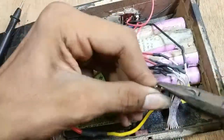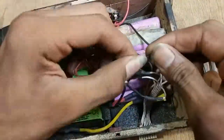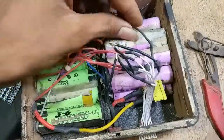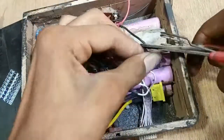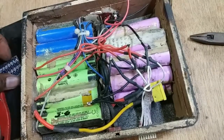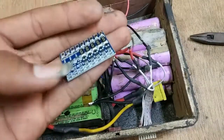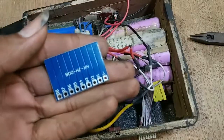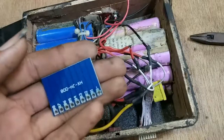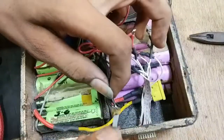Remove the insulation from the wires and be sure you don't short them when you do it. If you are a beginner in electronics or don't have a steady enough hand, then don't try to imitate it. Since my battery pack is 6 cells and this balance charge circuit only features up to 5 cells, I have to take risks and balance charge the last cell manually. If you prepare a battery pack of 2 to 5 cells, it will be the cheapest and best balance charger.